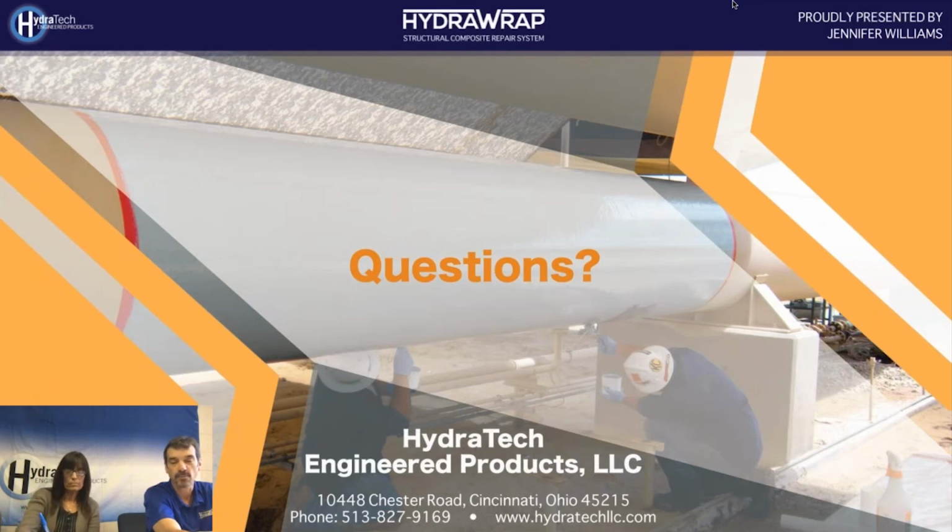Not to say that all projects can do that. There are hand tools, power hand tools that can provide a sufficient profile, but your longer service lives are going to be achieved with the better surface prep, and if you can abrasive blast, that would be preferred. Obviously, it's not conducive to all repairs, especially small point repairs, but there is tooling out there that can provide a very similar profile to what abrasive blast is doing.